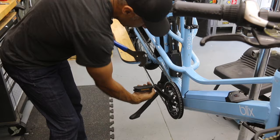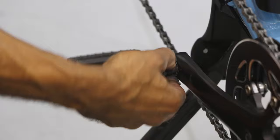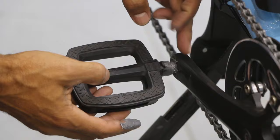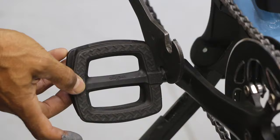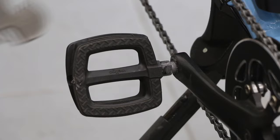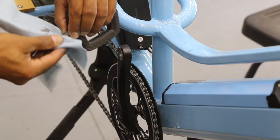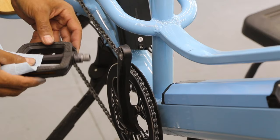There's kind of a grayish grease in there. That's most likely not the original color — it probably started totally different. Since this was incorrectly installed it was loose, migrating and turning, destroying the metal here. It took those metal threads and kind of mushed them into like a clay mixed with the grease and changed color. It's a little difficult to come off, but just keep working it — you're not going to do any other damage. Just keep working it until it's out completely.